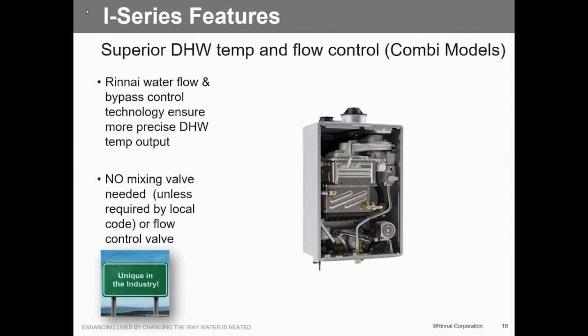So that low loss header doesn't have an isolation valve on it? Yeah. But it doesn't have a 3-way valve. I haven't seen them yet. 3-way valve for what? Cleaning? Oh, clean, yeah, it's still got all the same thing as you would see in a standard kit. It'll have your service valve, what you might call a 3-way valve, and then your shut-off valve. So why are you saying we need to purchase a separate one? Because for the domestic water side, the domestic water side has its own connection point. I got you. Okay. And that will come with the same setup. Not the Sensei setup, it's the standard old one that had the relief valve built into the hot water. So you'll have a separate setup for that one.